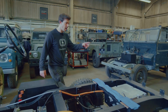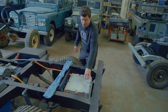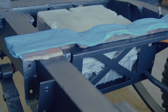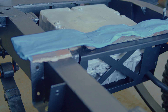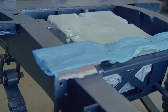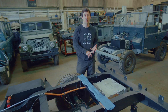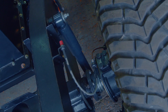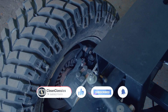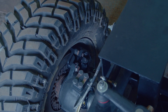I think we've got 30 kilowatt hours between these packs and then the final 10 kilowatt hours in the box at the front. Moving right to the back of the car, this is what's known as the PDM, from the Nissan Leaf. It's got the AC charger, the DC-to-DC — which is effectively your alternator, creating the 12 volts to make the rest of the vehicle work as it normally would. It's also got the capability for rapid charging, though we haven't got that tested or available yet. It effectively manages the high voltage system of the car and how it integrates with all the other systems.